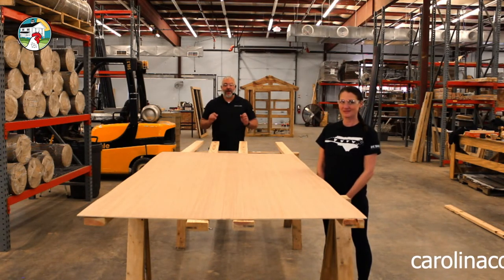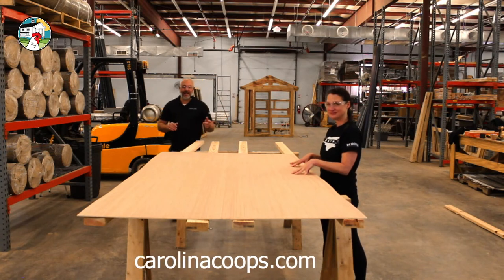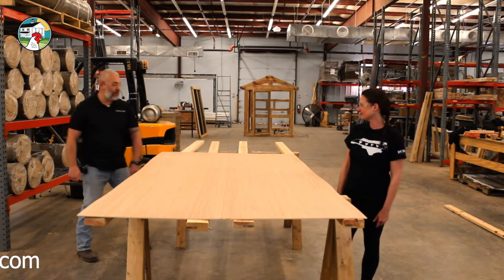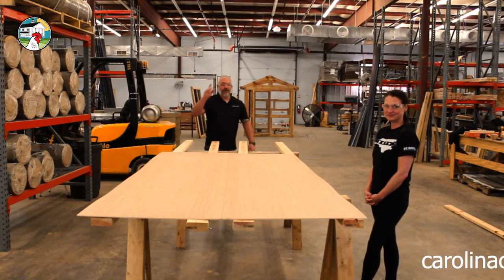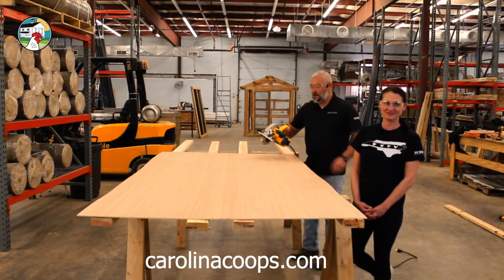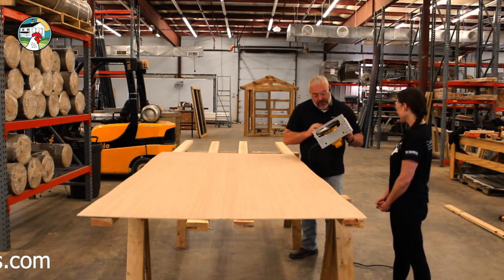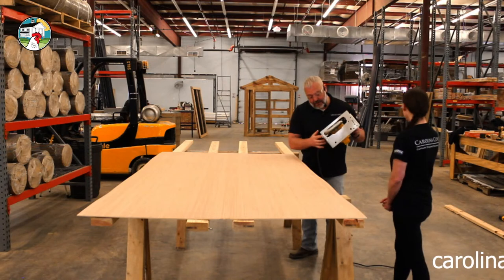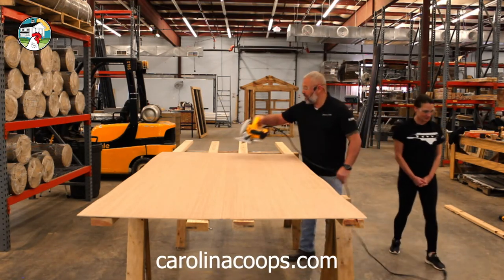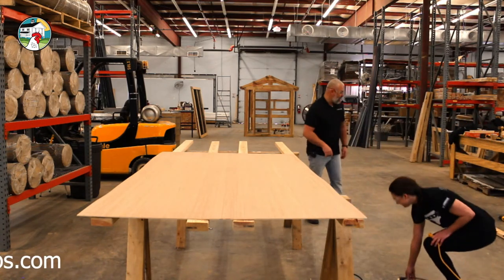They can turn the saw sideways and pull the board through — great point. Here's a circular saw — I just pulled this out of the shop. For safety's sake I'm going to lower the base plate just to expose a little bit of the blade. I'm going to show you guys a tip: this two by four isn't as straight as I'd like, but we're going to use it as a straight edge. You could freehand it with a tape measure, or you could even score the Luan with a utility knife and snap it for a nice clean cut.